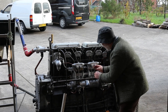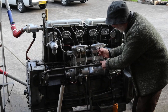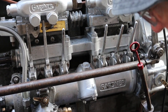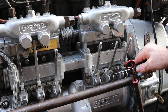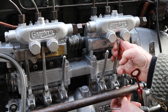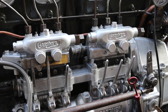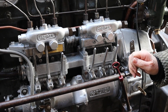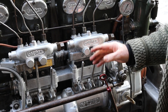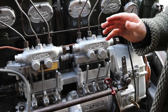Whenever you're pulling these down, they latch down using those little latches there. I can knock one off here, pull it down like this — I can feel the injector fire. Sometimes you need to hit them a little tap with the hammer to keep them in, and you need to be careful because they can spring back quite quickly and you can catch your hand in here. So you need to be careful.